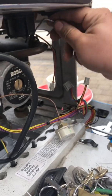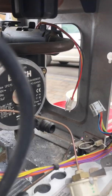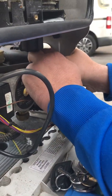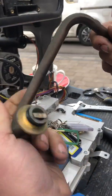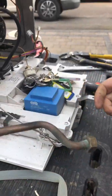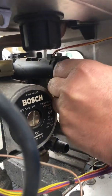This clip goes in there and locks it in position in front of the brass section. Once you've drained it down, you can pull that out like that, and that exposes the cold pipe. Now we took that off completely, but you'll see there's a filter in there — keep that in there because it stops any debris coming through and going into the boiler and clogging up the heat exchanger.